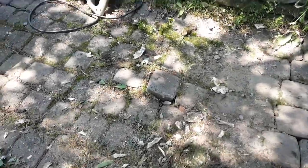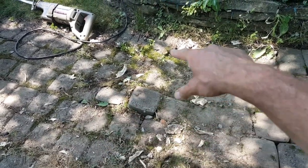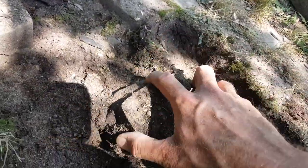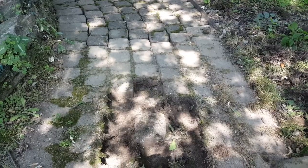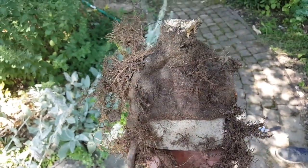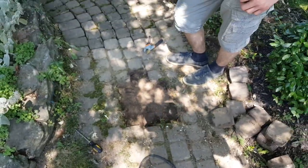If you have a situation like this where you just have one brick sticking up, all we're going to do is take out this little area, scrape down, re-level it and put the brick back in there. This brick is encased — there are roots all around it and it's jammed in there. This walk's been here for about 20 years. This is what happens to a brick walk, especially with trees around, but you can't avoid it, it's just part of the nature of things. This root has like sucked itself to the bottom of the brick. Isn't nature amazing? This is incredible. So we're just going to level that out by hand.